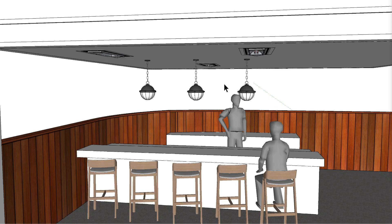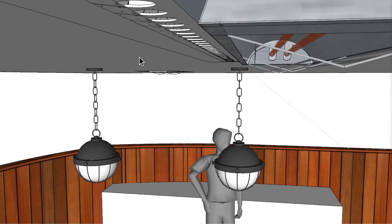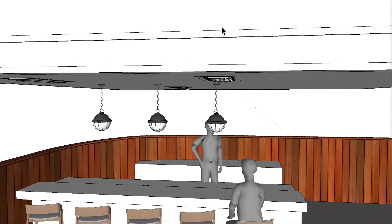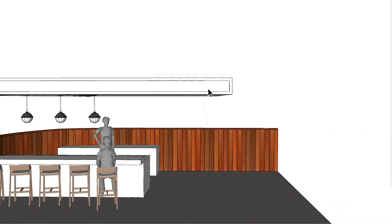One thing I want to mention: I'm not quite sure what the ceiling will be made of. If it's a combustible surface like wood, you need to meet all clearances to combustibles with regards to the finish. That means the heater itself would need to be dropped down to the elevation of the finished ceiling — for example, if it's tongue and groove or a wooden surface. If it's stucco, the heater could sit at the same elevation as the stucco. I don't have enough experience with ABS or similar materials to say how that would function.